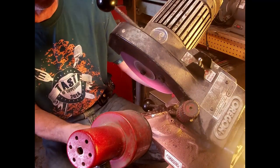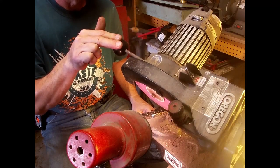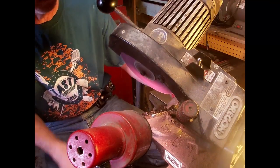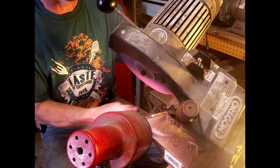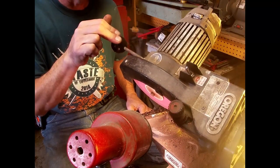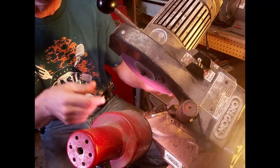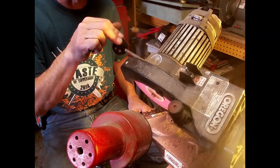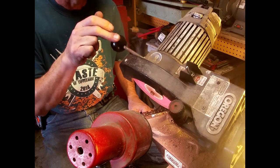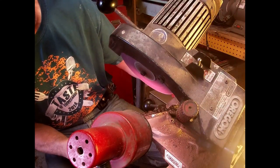When Oregon says to sharpen the chains, you should wash them in a paint thinner solution first, get all the junk off of them, then sharpen them, then soak them in oil overnight, and then wipe them with paint thinner again — not soak them, just wipe them with paint thinner again.